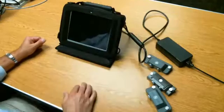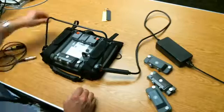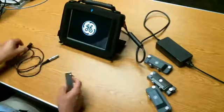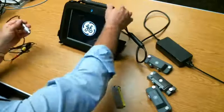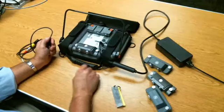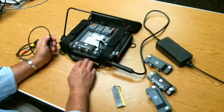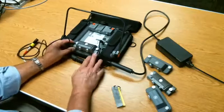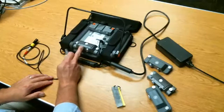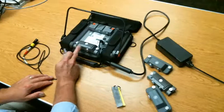At this point we can go ahead and turn the instrument on. While that's booting, I happen to have a differential probe — the probes plug in up top. Generally if you have an app that only uses one of the inputs, it's going to be on input one. An exception is conductivity, which uses input two, but that will all be handled for you with the conductivity app. If you have a dual input with the probe adapter facing upward, input one will be on the left and input two will be on the right.